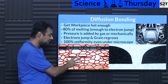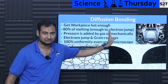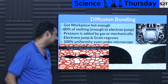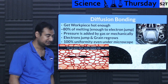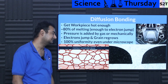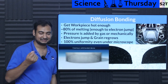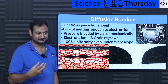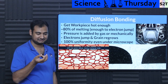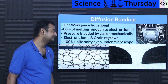The crystals grow to a point where no single crystal acknowledges a border — it becomes completely ingrown. That's the whole point — that's what the diffusion aspect is: it slowly diffuses over time. 100% uniformity can be achieved, meaning no matter what technology you use, you cannot find where the joint starts and ends. I had the luxury of seeing this in real-world use in a CO2 supercritical electrical system, and it was mind-boggling. The first time I held the piece, it literally felt like one hard thing with no layers.